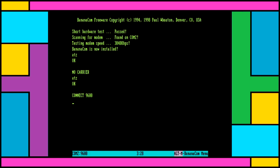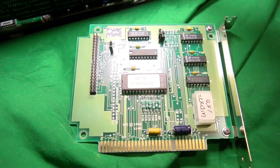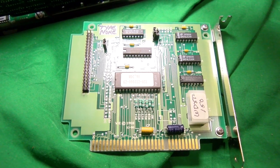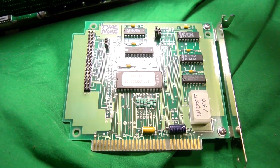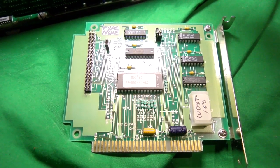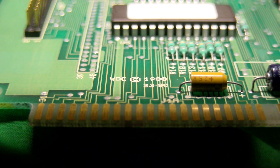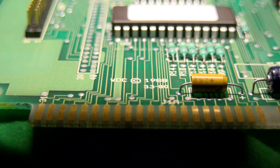But anyway, at long last, let's move on to the expansion cards. To start with, we have a hard drive host adapter, which eats an IRQ and DMA channel, as well as living on port 320 hex. And now all the things we covered in the 286 video make sense, don't they? There is no IRQ14 to live at on an 8-bit expansion bus like this. And my older 286's BIOS, whilst the machine does have the 16-bit bus and second 8259, doesn't assume the hard drive will be anywhere but where it was on the 8-bit machines.